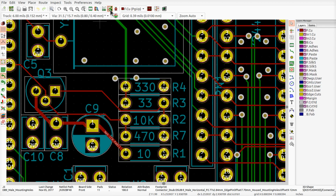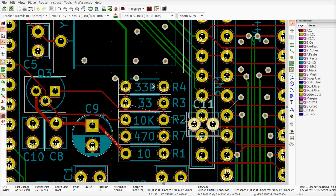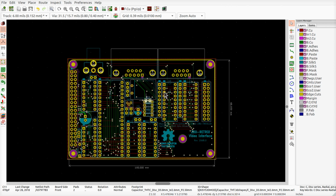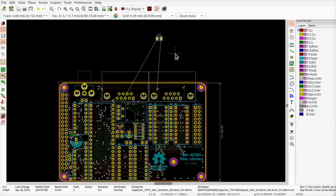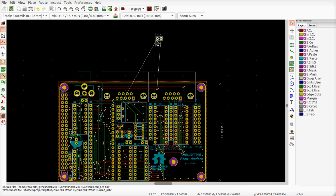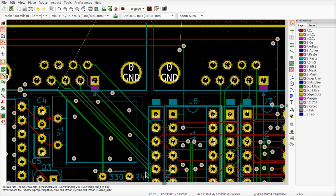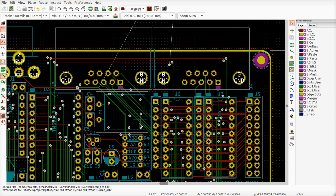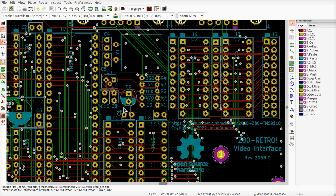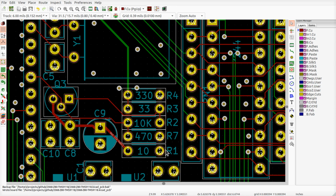If we import the modifications, it should gripe that I don't have a... Actually, I copied another one of the capacitors. Yeah, so this thinks it's that capacitor. Now, the one that I have is like 1,000 volts, so it's physically very large. I could probably find a tiny one that would fit in this socket or whatever the footprint they gave me, because all I did is copy one of these other ones when I put that on there. So if I delete R4...